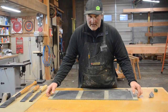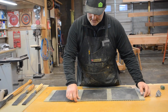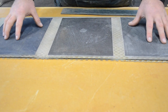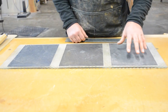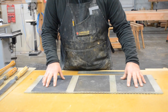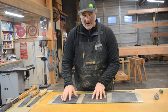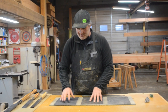What you're also going to need is a piece of glass. You want a quarter inch thick glass, three feet by one foot, and that way it will allow you to put three different pieces of sandpaper on there. From there you want an aggressive, medium, and fine. I use emery cloth for the first two — this is a medium aggressiveness, this is a fine — and then this is a 400 grit finishing sandpaper. That's going to be what I do my finishing on.